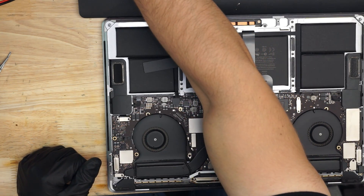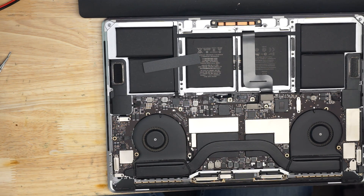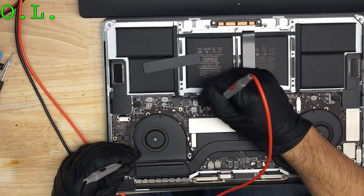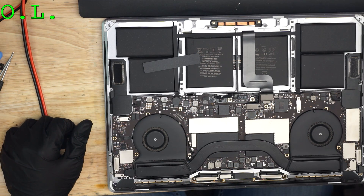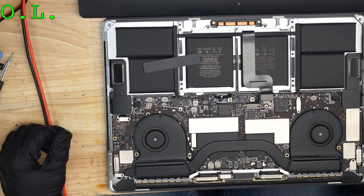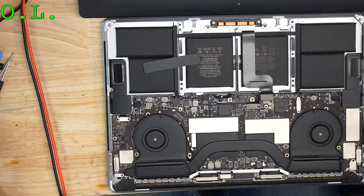The first thing I'm going to do is turn on Paul Daniels' multimeter software. You can find it at pldaniels.com or his YouTube channel at youtube.com/19pld73. PPBus G3 hot is showing a 15.6 ohm short to ground. Now why did I measure that spot? Let's open up a schematic for an 820-00281 board. Schematics you'll have to find online on your own; the software to read them you can find at pldaniels.com.